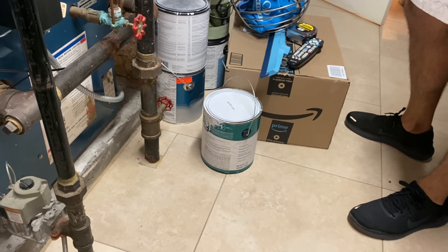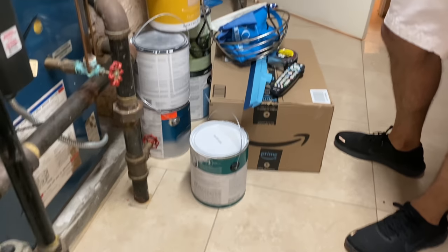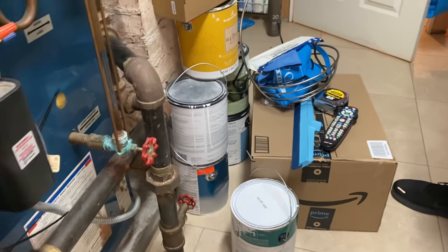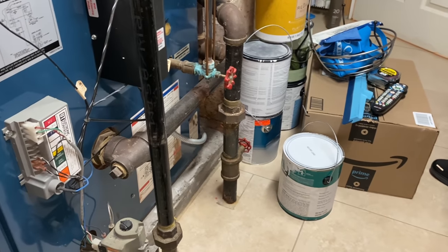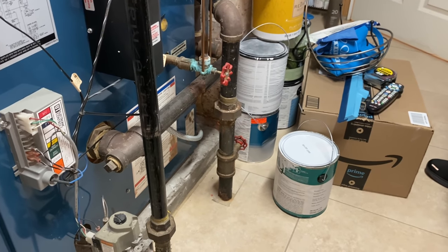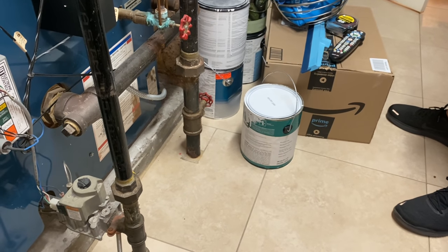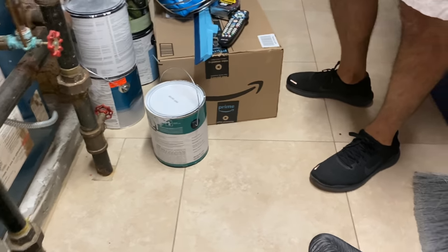So it's one of two things. Number one, you have too much pressure in the system. And it's causing that, and that's maybe because the pigtail is dirty. This is the pigtail. This keeps the latent heat off of the pressure control. So if that's clogged, the boiler can build up too much pressure, and you can cause that banging sound. Alternatively, you have a clogged wet return, and water, condensate, is not making its way back to the boiler. Okay. Make sense? Yeah. We got to see where the other end of this is, which is, yeah, let's go see.